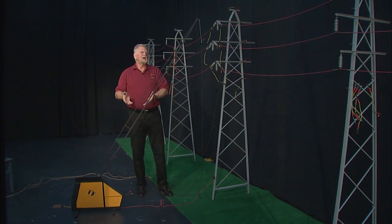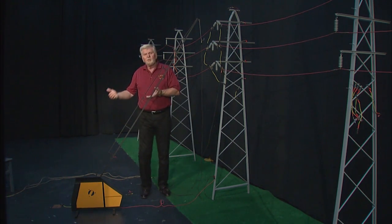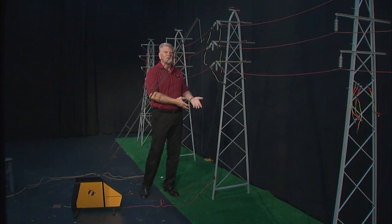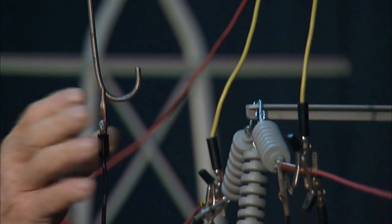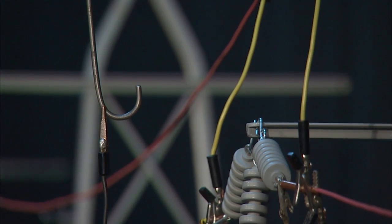If this mobile equipment was an aerial work platform, then not only should we be grounding the base and chassis of that equipment to the common work source grounds, but we should also be placing an equipotential bond from the aerial work platform to the conductor being worked. This will ensure that the worker always has a parallel path around them should there be a current flow to the work platform and through the boom. Regardless of what the conductive object is, the only way we can ensure that the worker has an effective equipotential zone is to ground and bond any conductive objects or potential ground sources at the work site that contact will be made to or clearances will be violated while contacting either a grounded conductor or the structure itself.